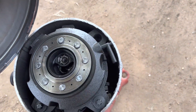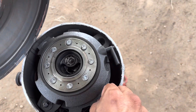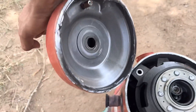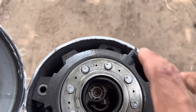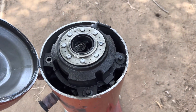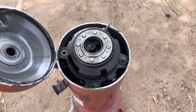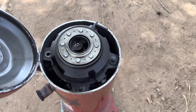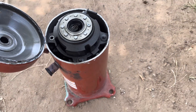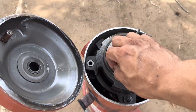The scroll assembly broke — these two came out, it's two screws. It sounded like rocks in there. This compressor actually took out the main panel. I'm going to get these two out and take them out. Here is your floating seal.